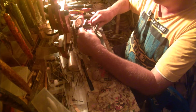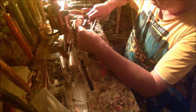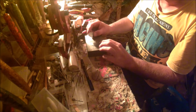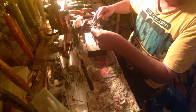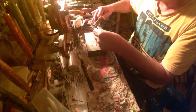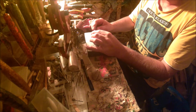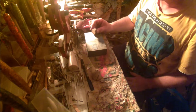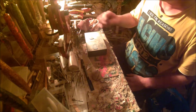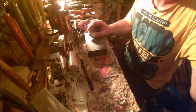See, aluminum comes very easy to cut with shears. Go close to the marker line, because the grinding would heat it up pretty much. In case it gets too hot when grinding, put it in water or lay it flat on the steel plate to take the heat out of it. I wouldn't suggest water, because it might wipe away your marker line. So better if the part gets too hot, put it on a steel plate for a minute or two to cool down. So now I will grind this one to shape without the camera.